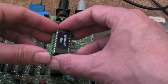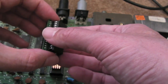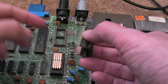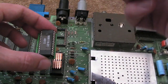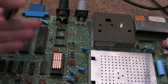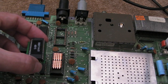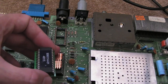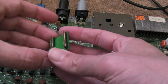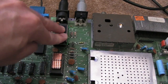If you have that combination in your system, please post in the comments below. It looks like the issue is with the nano SwinSID rather than the PLA itself. It could be that the timing is not quite the same as an actual PLA and the nano SwinSID has been programmed to the exact timing of an original. But I'd think it's the former, because everything else works with this — games, carts, no compatibility issues with anything. If it were a timing issue, you'd expect it to manifest in other ways, not just affect the nano SwinSID.